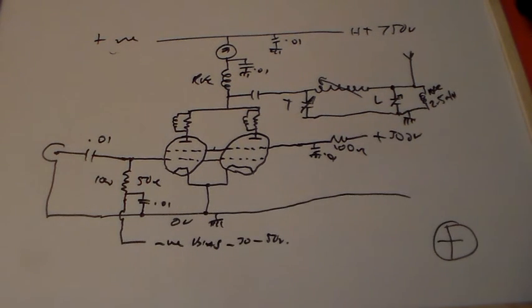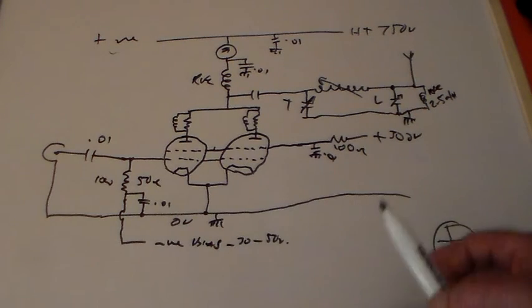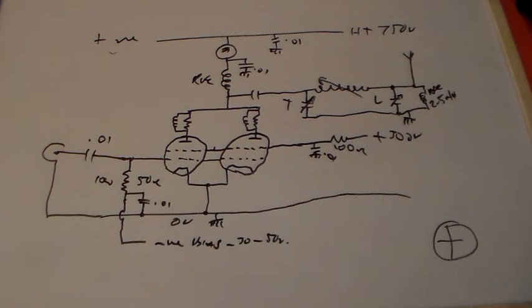So there we go — they're really great, great old tubes. Very versatile. You can use them for audio, you can use them for RF. I think they give full output power up to about 30 MHz. It's a very long time since I've looked at the specification for 807s, but I've certainly used many of them in the past. I've used pairs, multiple pairs in parallel, series modulated them, screen grid modulated them, as well as high level modulation, choke modulation. I've done pretty much everything you can with these 807s. I've used them in push-pull audio amplifiers and modulators. So I had a lot of fun with these things quite some time ago. Great, great old tubes. A tribute to the venerable 807 beam power tetrode.